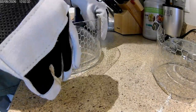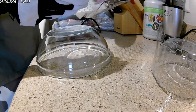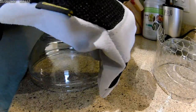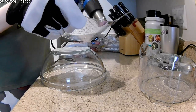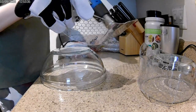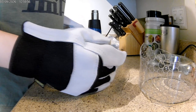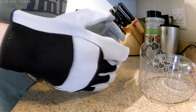The big benefit of forming before cutting is the flat edges along the top and bottom of the piece — these rest against the counter and the edge of whatever you're working on to keep things even along the cross section. Shaping both the top and bottom with a consistent solid shape makes it a lot easier to get a consistent curve throughout, and it also helps reduce the edges bending out as you curve the plate in. You're only really able to bend a few inches at a time, so just move through iteratively from one end to the other until you've got a nice curve throughout. The first form I'm using is this large glass bowl — I got the profile to match as close as I can, but you can't perfectly match it due to spring back in the material.